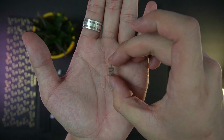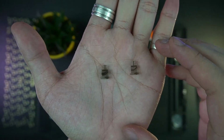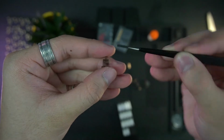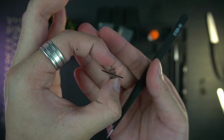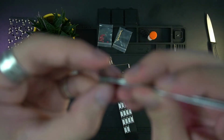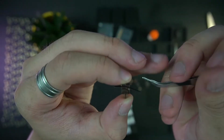Yeah. And I'm also doing kind of like a holee mod kind of thing, but I was too lazy to actually cut band-aid, so I just used the sides of the stab film thingy, and I put it in there, and I used that as kind of like a holee mod replacement. So I took a tweezer and then I pushed the tape against the insides of the stabilizer stem. I pushed really hard so they won't come off.